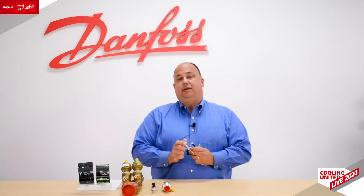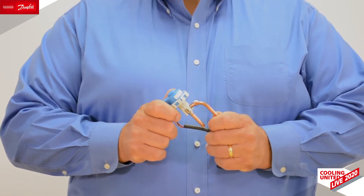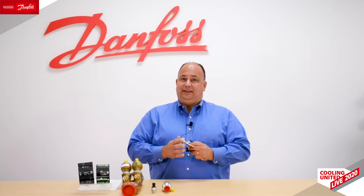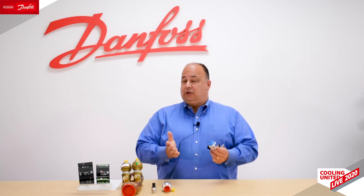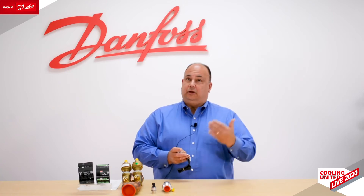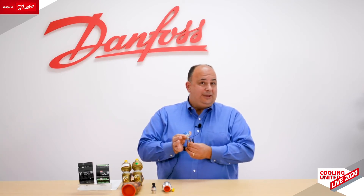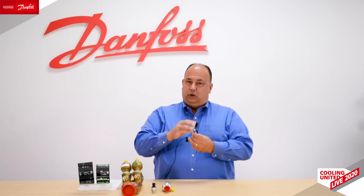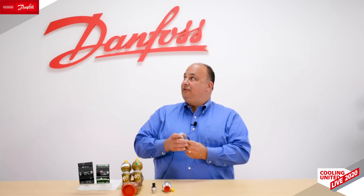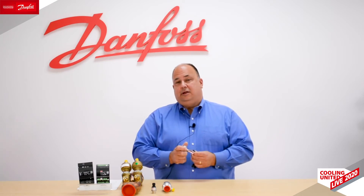We start with our newest family member, the Danfoss ETS-5M. It's a small electric expansion valve, good up to about 5.5 tons or about 20 kilowatts. It's designed primarily for high-density, 410A-like refrigerants — so it works with R410A, and also next-generation refrigerants like R32, R454B, and R452B. It's a small compact valve that works very well in indoor VRF units. It's also very quiet — the coil is quiet with no mechanical clicking, and it's designed to minimize gas flow noise through the valve, so there are no noise issues indoors. It also works very well in residential heat pumps and computer room air conditioning units.